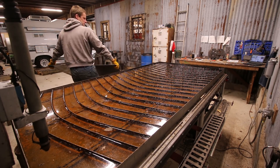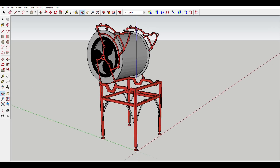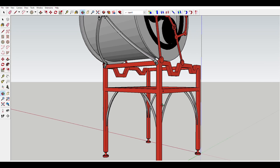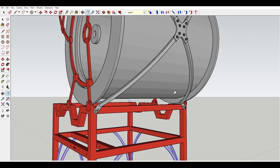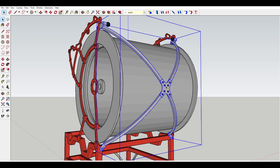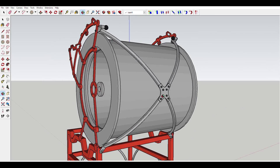I was working mostly with Marius, who sent me the 3D model of the machine and the parts I was to make. The first part they needed were corner gussets on the lower frame to help stiffen things up — pretty straightforward parts to be cut on the CNC table. The second part was a bit more complex: rolled cross bracing that matches the curve of the programming drum. It was a little intimidating jumping in because I wasn't going to have the Marble Machine in front of me to test fit pieces — I'd have to study the 3D model and make sure the parts were to the exact same measurements and dimensions.